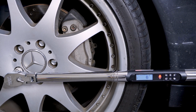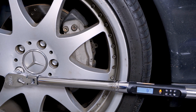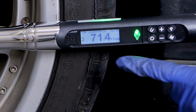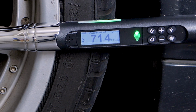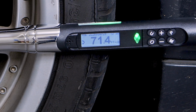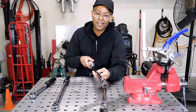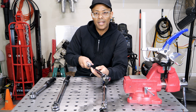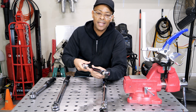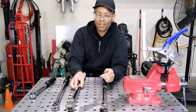Now, one thing that does come up with torque angle, so this torque wrench, one thing that's interesting that threw me off is that you don't feel that break when you hit your torque limit. So with the click type, when you set your torque to, let's say, 50 foot-pounds or something, then you get that nice break, that nice click. So you can torque almost with confidence and reassurance that okay, hey, I'm gonna hit my click and then that's that, right? And so that's really nice.